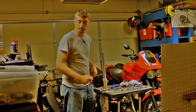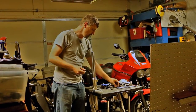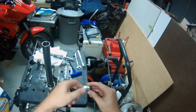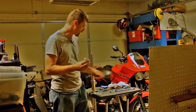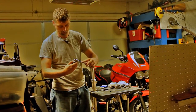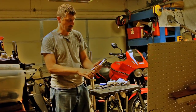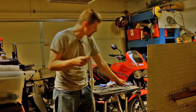I do have a welder, but I don't want to ruin a socket, and I think there's a simpler way that doesn't involve welding and can be taken back apart when done. What I do is get two nuts that will thread onto the bolt and put them on in a jam nut configuration. The nuts lock against each other — you put one wrench on each nut and tighten them against each other. You can set your wrenches one surface apart and squeeze them together to get the nuts extremely tight.